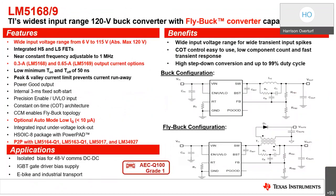The LM5169 and LM5168 synchronous buck converters are designed to regulate over a wide input voltage range and minimize the need for external surge suppression components. They have a minimal controllable on-time of 50 nanoseconds, facilitating large step-down conversion ratios and enabling direct step-down from a 48-volt nominal input to low voltage rails for reduced system complexity and solution cost. The LM5168 supports a maximum output current of 300 milliamps, while the LM5169 supports 650 milliamps. Both utilize constant on-time control for ease of use, low component count, and fast transient response. These devices are pin-to-pin compatible with the LM5164 and LM5163.